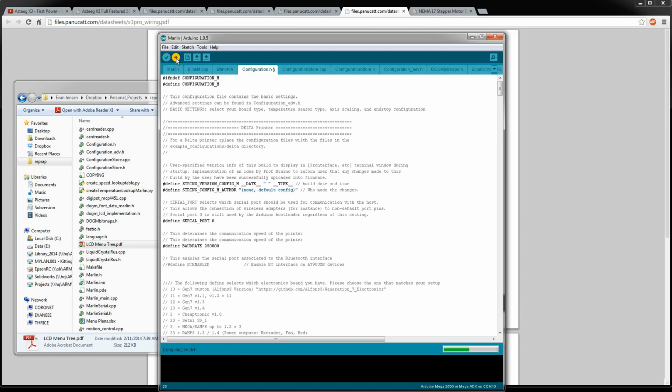and hopefully it's recompiling on upload. Really, you just have to hit upload and then it'll compile it and then upload it. But I kind of expected errors, so the things I'd have to tweak, but seems good so far. Still uploading. And the way they've done this, the more features you enable, the more memory you're going to use. So you got to be pretty memory conscious on these 8-bit microcontrollers. They just don't have that much in storage.